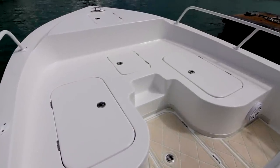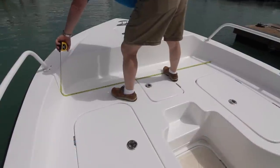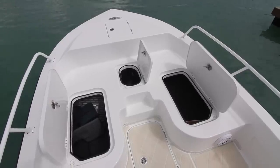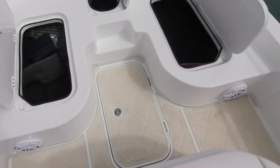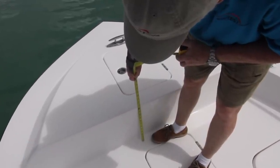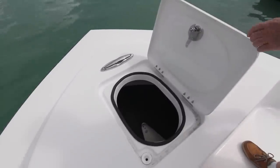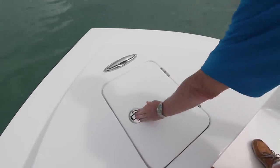The bow is well suited for fishing with a raised platform. A center step eases the transition from deck level. The sides come out 5 feet 2 inches, while the narrowest measurement at the front is 6 feet 4 inches wide. With the bulwarks and rails, this has the feel of a very secure area. Storage is in three compartments with flush-mounted hatch hardware. Tension hinges hold the hatches open, and all the openings are gasketed against water intrusion. Still another hatch is in the deck just behind, leading to even more storage. If we want to be at a higher level for casting, the foredeck is another 12 inches up, and a hatch leads to an anchor locker. This hatch being right in the center of the deck creates the use for an optional windlass under the hatch and the anchor running through the stem, further putting the emphasis on casting. The hatch opens with a turn and lock latch, and tension hinges hold it open. A pull-up cleat just ahead ensures a clean and snag-slash-trip-free surface.